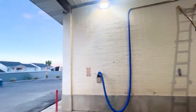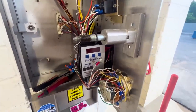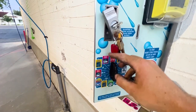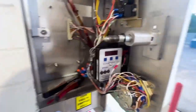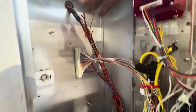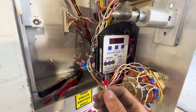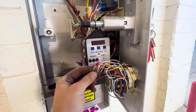It's starting to look complete but we have one more step and we're getting close to running out of daylight — the bay lights are turned on now from the sun going down. We need to connect our rotary switch. I've turned off the power to the meter box. We're going to take this rinse function right there and turn that into air dry. Ideally it would be on spot free, but I already have two other rinses I can switch later. On the back side, I had a blue wire that was extra — I stole it, ran it into my terminal strip which runs over to my rotary switch, crimped a new end on it, and we're going to eliminate that rinse on the brown and yellow and stick this on the hot side.